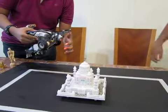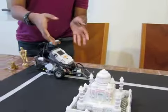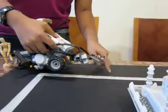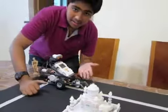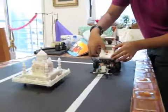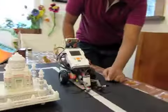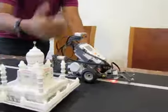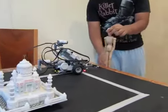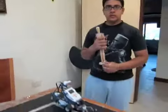As you can see, I have placed this sensor according to the different types of tracks. One is the light track and one is the dark track. We've used logic and placed it like this so that it doesn't go right or left — it will keep moving straight. This detects dark and light and keeps moving both its wheels left and right. And if anyone comes within 25 centimeters of its path, the ultrasonic sensor will sound an alarm.